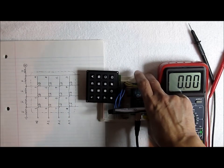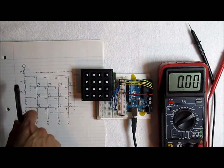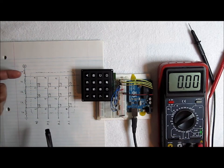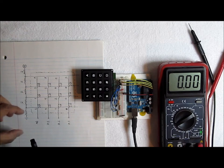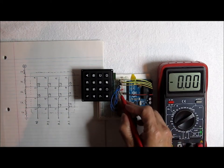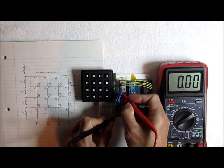The way it works is by using a voltage ladder. I'll rotate this circuit so it makes more sense. A voltage ladder is a bunch of resistors in series. To keep things simple I used the same resistor value — these are all 1k ohm resistors, five of them in series from zero to five volts. Using Ohm's law, because these are equal values they divide the voltage into equal parts. By coincidence I have five of them and this is 5V, so each one is worth 1V. I can show you right here — there's +5V on one end and ground on the other.